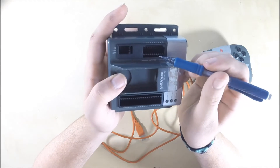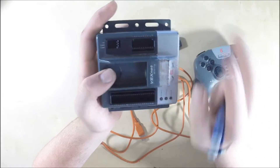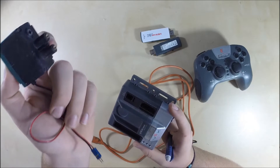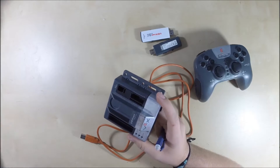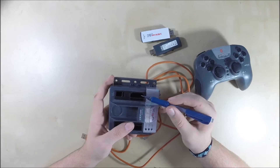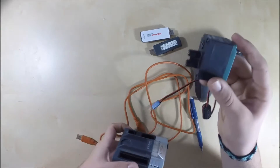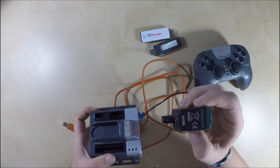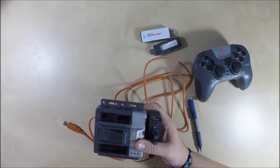Motors 1 and 10 are 2-wire only, so those are only good for motors that have a 2-wire plug on them. If you have an older 3-wire motor, that will not work. If you're using a motor controller with a 3-wire end, that won't work either. So ports 1 and 10 are great for your back wheels or your lift, because generally those motors are really close to your cortex. You can just plug them straight in, or if needed, use a 2-wire extension cable.